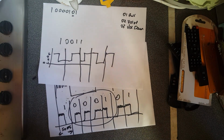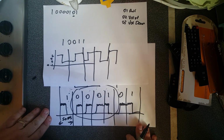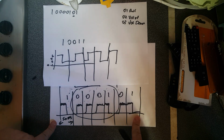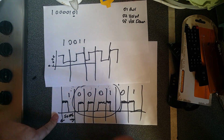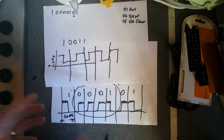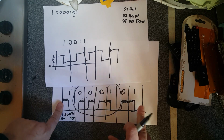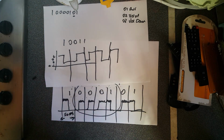So yeah, it's quite ingenious really how it works. It's simple, and as the batteries run down and it literally slows down the speed at which it's sending out, the TV can cope with that because the Manchester encoding lets it see what is being sent regardless of the clock speed. And as long as you've got something that identifies the start and the end, in this case sending a 1, and it expects 5 bits in between, which it derives the number from, everything is hunky-dory.